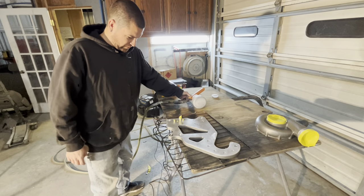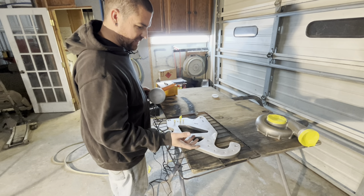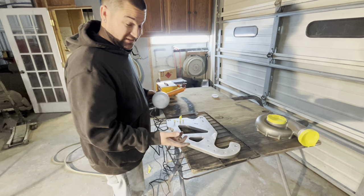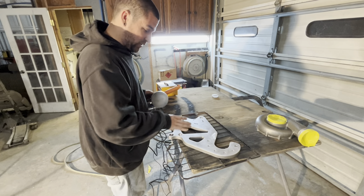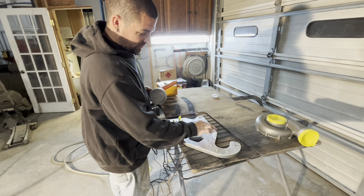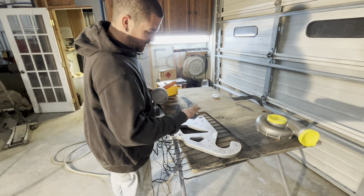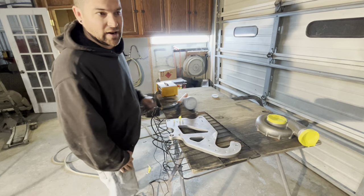I'm not a professional powder coater. My bracket may be anodized — I Googled it and it said you can powder coat over anodized aluminum, though one place said you need to scuff it up and wipe it down. All I did was clearance it out, 180'd it, and blew it off. I didn't even wipe it down — probably should. Let's grab a rag real fast.